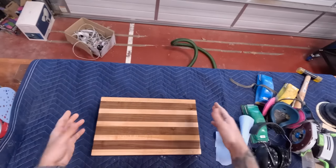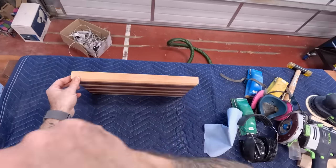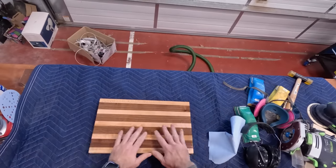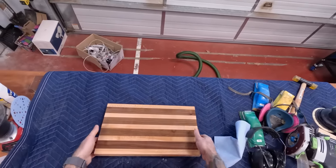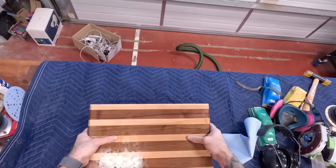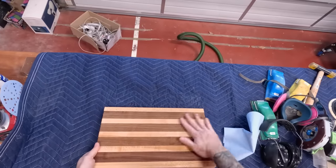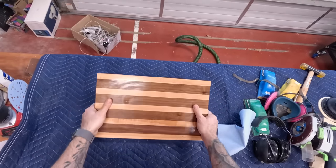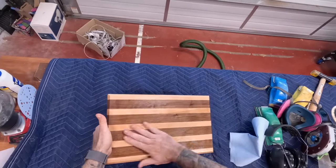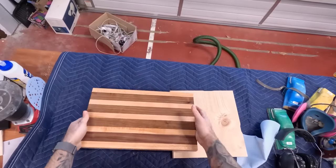Especially if you are selling cutting boards, this is a great thing to do. It's just a little courtesy that makes sure that when a person actually uses this thing and has to clean it for the first time, there are no surprises — you don't want that email saying 'my cutting board just got all rough and all I did was use it.' So this is one of those little insurance policies. I just want to keep the surface wet and give that grain an opportunity to raise up, without dipping the whole thing in water. Then I'll just prop it up and let it dry.